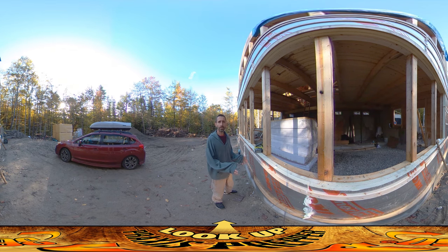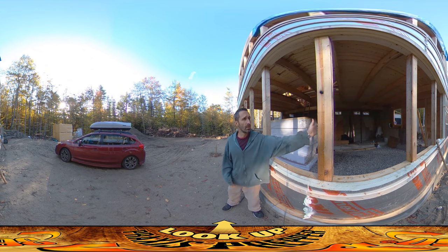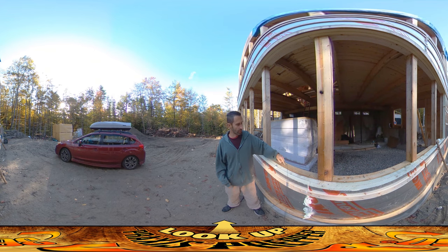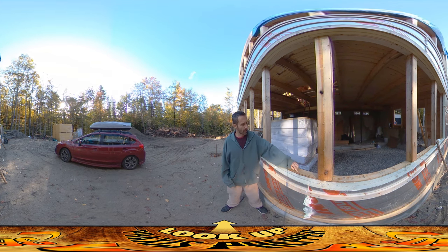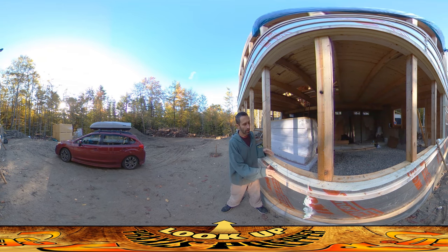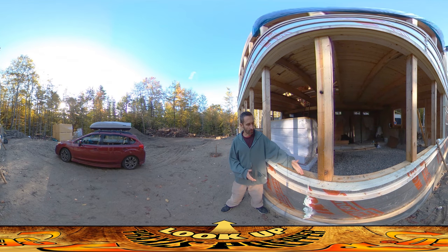I positioned us right here because a lot of people have asked about how the layering works. You can see the interior posts right here, and the inside wall boards that you actually see from the inside are right here. On top of that is two layers of foam layered right on top. Normally, if you're going to do a house wrap, it would go between the foam and those interior wall boards.